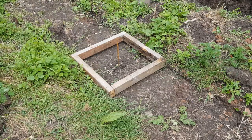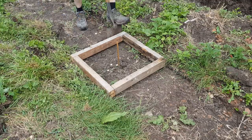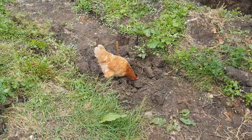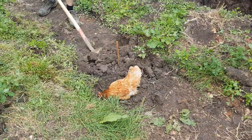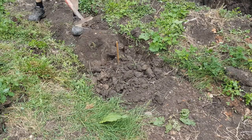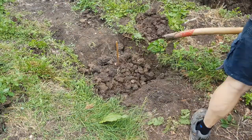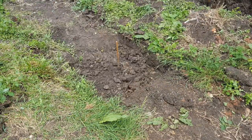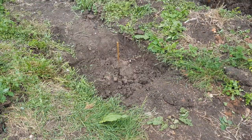Let's kick off by breaking ground. I used a wooden frame template that was aligned to one of the marker posts, which made sure all the pads were in line with each other and built to the correct size. With the help of my chief building inspector, I dug out the shape of the pad and took it down to the desired depth, which is the top of the clay. I then got out my petrol auger and bored a hole as deep as I could.